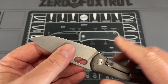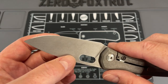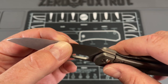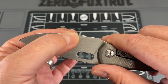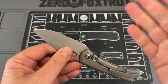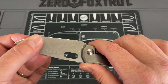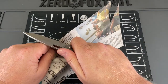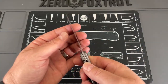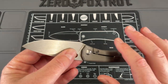That's because Alex has got on this knife what I think is just about perfect blade geometry, behind-the-edge thickness, and everything combined. What you have is a blade that transitions down nice and gradually to an extremely thin 0.010 behind the edge. That allows you not just a very thin edge, but an overall behind-the-edge geometry and blade geometry that does the cutting. The edge is just the cherry on top — the blade and that geometry are what's doing the cutting, and it allows it to scream through everything. Once I did resharpen it, this thing is just terrifyingly sharp. It's one of the few knives I'm actually nervous about when I've got it in hand, because if I do cut myself with it, it's cutting for keeps — it's going to be a super deep cut because it's just not going to stop.